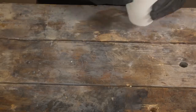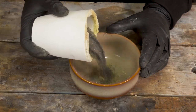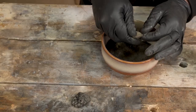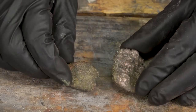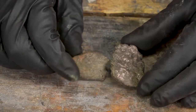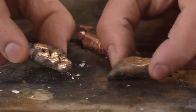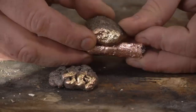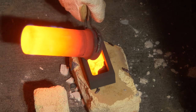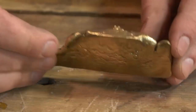After running the kiln for the better part of a day, we have the results. It's not necessary for the brass to actually melt — this could be still solid copper — but it does look like it melted into two nuggets, which is a good sign. It almost looked a little bit coppery on the surface, so I cleaned them up with a wire brush to reveal a very distinct brass yellow color. Comparing with normal copper, you can see the very clear color difference. We have succeeded — we have made brass. Next, we're going to melt down these two nuggets and cast them into a solid ingot.